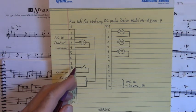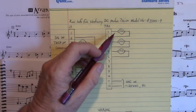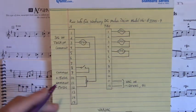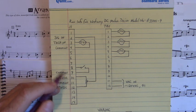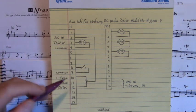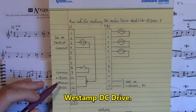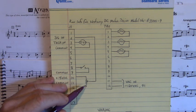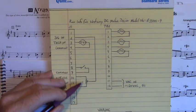Down here on pins eight and nine of J1 — if the eight and nine contact inputs are open, that motor will run. To stop or disable that motor, we close eight to nine. I didn't have a switch on eight and nine; I just left it open, and when we powered up that Westamp DC motor it automatically got up and ran.